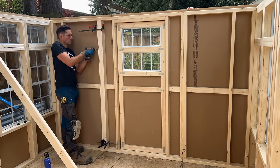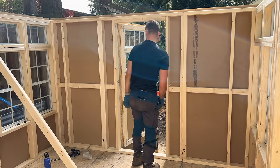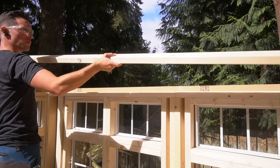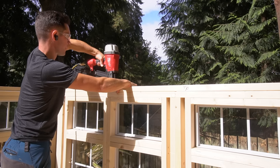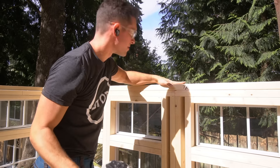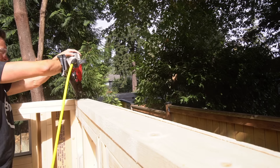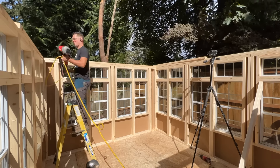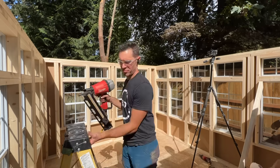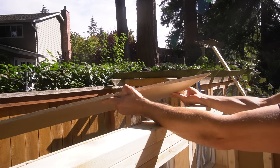With our entire wall structure fully assembled and secured to our floor joists, we are now ready to move on to our top cap. These 2x4s are noted as TP for top plate, and with my framing nailer I easily secure them to the top of our wall structure. This is the beauty of this greenhouse kit — every single one of these boards is labeled as TP and I didn't have to cut a single one. They all come pre-cut like everything else, which means faster installation in the long run. Now that we have those accounted for, we can move on to our soffit panels.